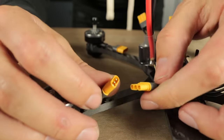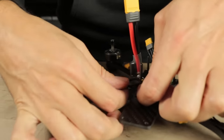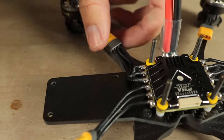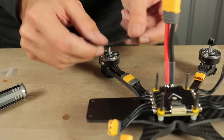Now we get to do the really cool part and start plugging things in. The connectors are keyed so you can't even do it backwards if you wanted to. Your motor is now connected to your ESC. For anyone that's built a drone before, they know that's the time consuming part — soldering all the motors to the ESCs, or if using individual ESCs, soldering the motor to the ESC and then to a power distribution board. So time consuming. This is super easy — no heat, no irons, nothing. So this is going to be great for your first build. Now here's where you can finesse things a little bit. Push the connector down so it's against the arm, route the wires so that they look good. You can tape down the wires or tape over the connector. Once the rest of the drone is built you're not going to see it too much, but I like everything to be very neat. Let's do it for the other four. All right, all the motors are installed.